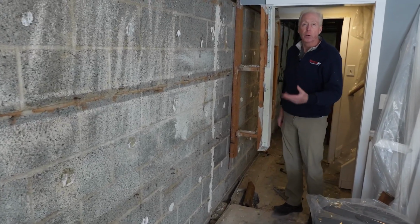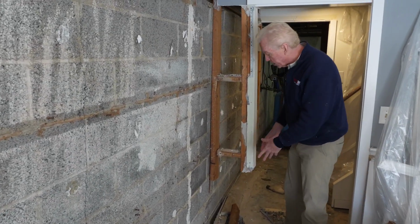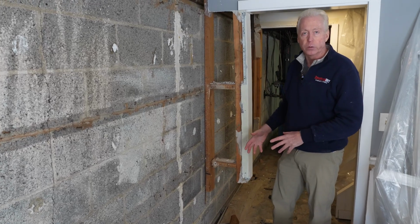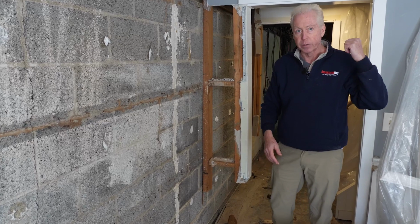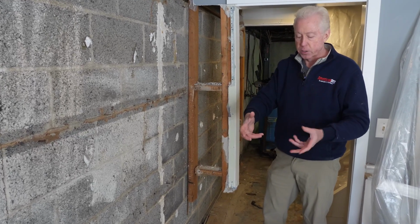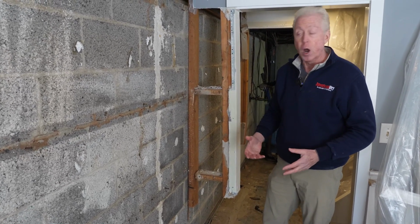We were talking with the owner who actually did the prep work, and he said as he removed the boards, they were all completely dry rotted, just like we were talking about over in the other area. And there's another area in the front where he took a board out and it basically turned to sand. That's how dry rotted it was. This is a perfect example of what you don't want to do when you're trying to waterproof your basement.